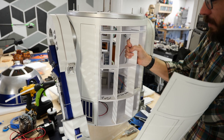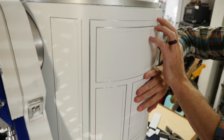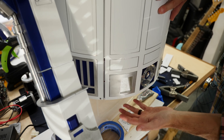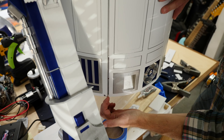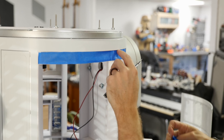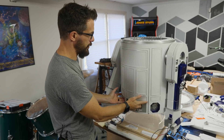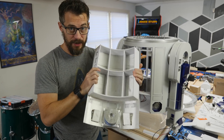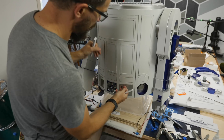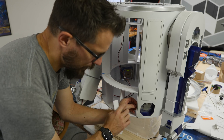These will be glued together. One of the problems I found when testing this out was that by putting on the outer skins first, I've ended up with some gaps. Up at the top it actually looks just fine — we've got about the normal size gap all the way around — but down here on the bottom, the pieces kind of spread out, so you get more gap on either side. Unfortunately, there's not really anything I can do about that at this point, so I'm going to have to make this door up and then put in some filler pieces on the inside of the body to cover that gap. The glue has dried on this back panel, so now R2 has a door that comes off and takes the structure with it. I've cut down some more pieces of white styrene to glue right in against that edge to fill the gap, and then I can even go back and paint this edge to make it look like aluminum to make it fade away even more.